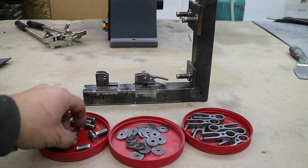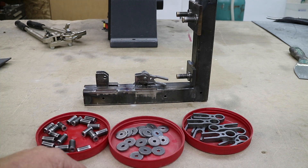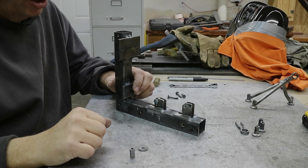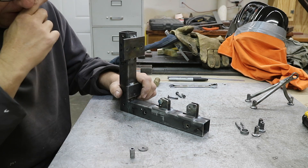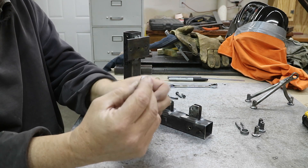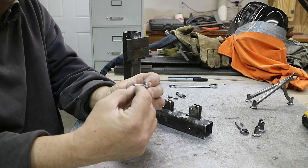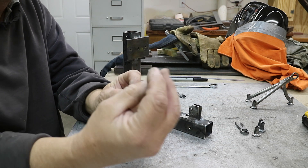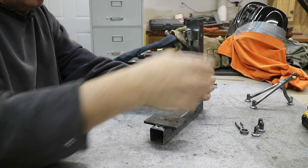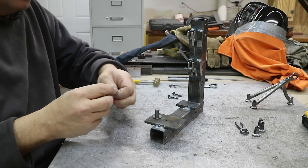Here's all the little pieces and parts I needed to manufacture for the aileron and flap mounts. Now that I have my fixture done I'm going to start working on the aileron mounts. The first step is to take one of these little tubes — actually three of them in this case because I'm going to do the one with three legs. I'll take a washer and a tube, mount them with one of the bolts, and then weld them together.